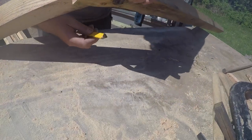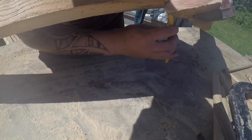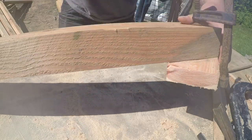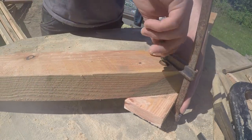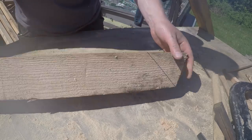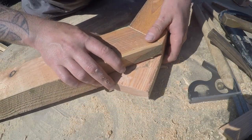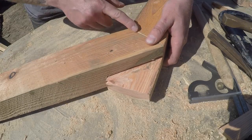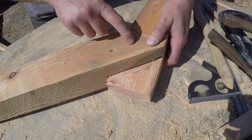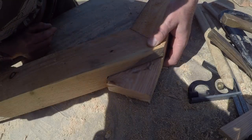So now we're gonna mark the underside of here — that's where that's gonna sit in. Make sure it's a nice visible line. So that's our line. We're gonna cut down to there, half lap, and those two pieces half lap together. There's our half lap. So those two pieces come together like that. There's a bit of a step because the bits of wood are slightly different sizes, so we'll plane that. They're gonna get pinned and pegged together. Probably put some glue in there as well, just for extra support. Get that done and then leave it to dry.